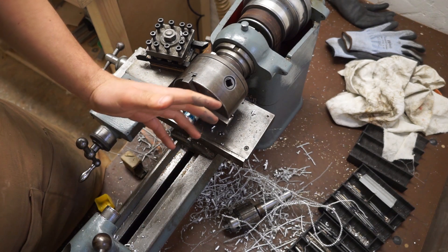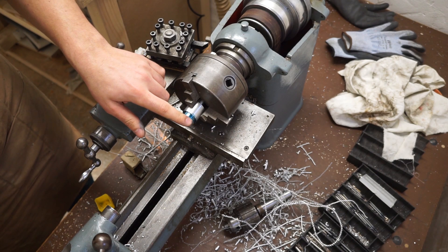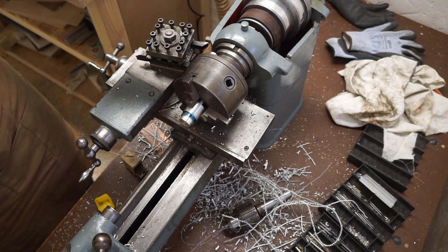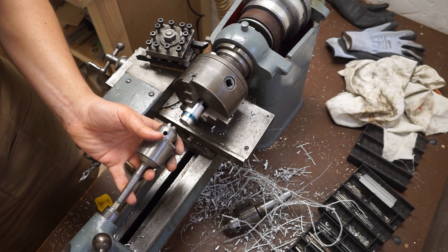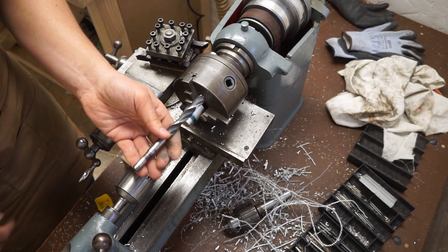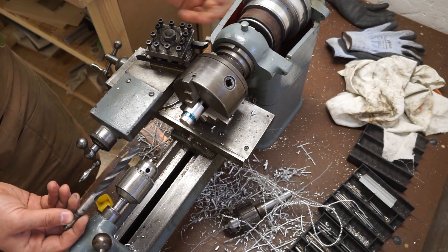The camera turned off. I turned down this shoulder to 19.9mm because the bore, as far as I can measure, is 20mm, but I can't really test fit it yet. The next thing I'm going to do is use my tailstock to drill a 12mm hole using a wood cutting drill bit, because I don't have one for metal — but it's aluminum, so that should work.